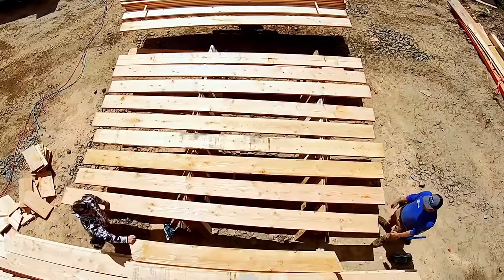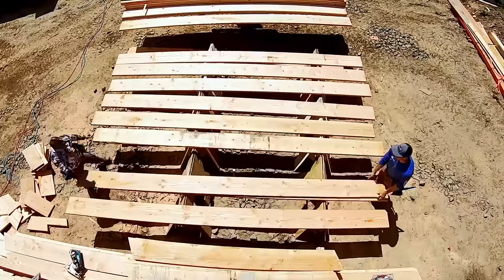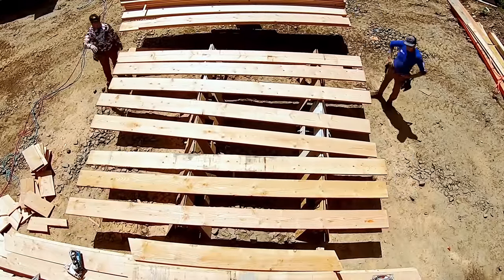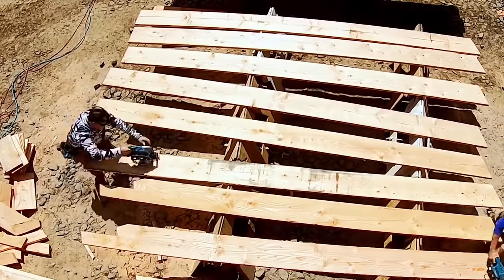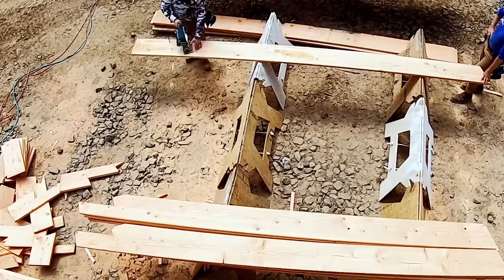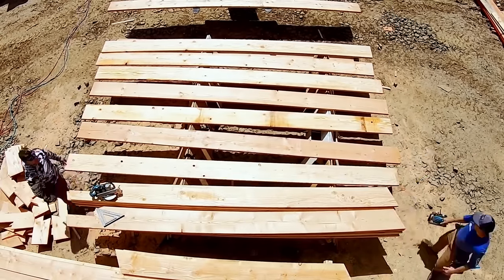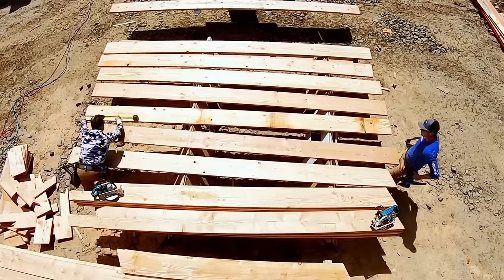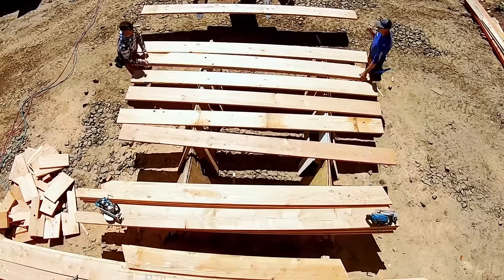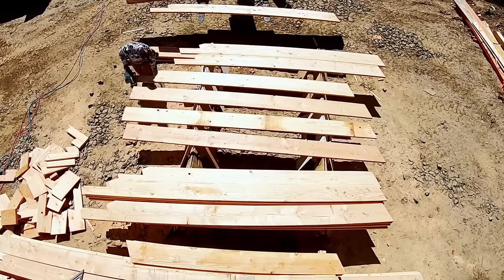One thing to notice, right where I was just cleaning up scrap, we have a pile of blocks that are cut 22 7/16. So as we're cutting rafters, knowing that we have extra length, we cut those 22 7/16. Those are mostly going to become our bird blocks, but in some cases, we're gonna rip them in half with a bevel and they're gonna become our blocking at the top of the rafter at the ridge. That's gonna be our boundary nailing for our roof sheathing. And it also acts like a little bit of a pressure block. So anyway, we'll come back to that. You'll see how that all works. But essentially, we're cutting our blocks at the same time that we're cutting our rafters. And again, it's just one of those things that helps you to save a step.